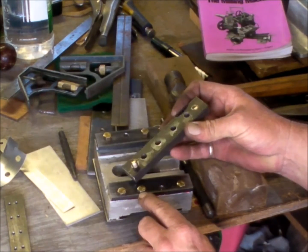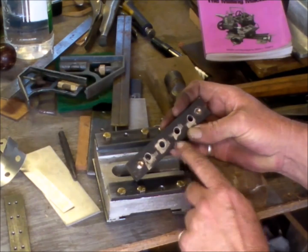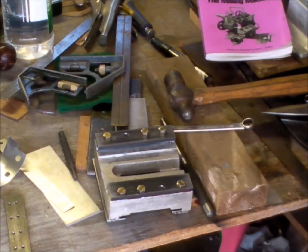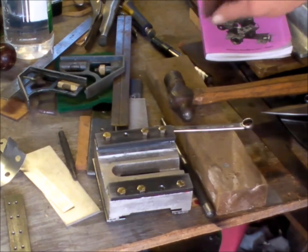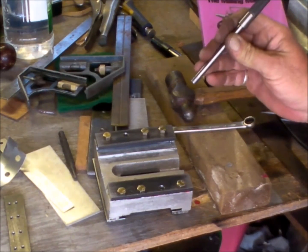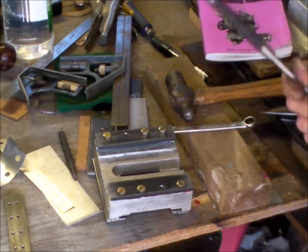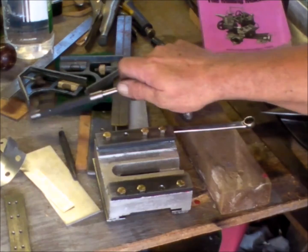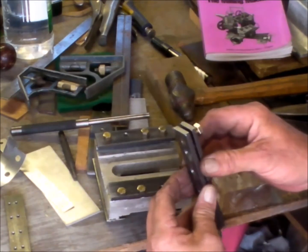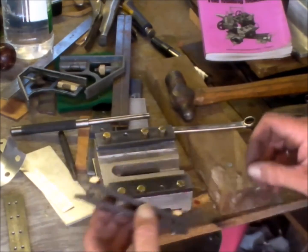I'll point out that this is a 6mm bolt and that is a 7mm hole. It wasn't metric because my old punch — it's a very old punch — it must be an imperial size. Yeah, 5/16ths. I still have plenty of imperial fasteners and a good collection of imperial drills, so I made these plates and it works well.